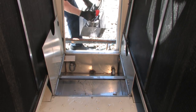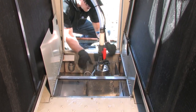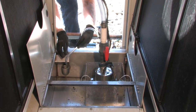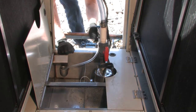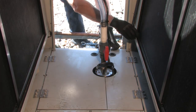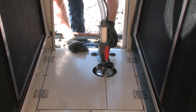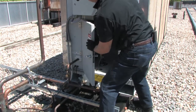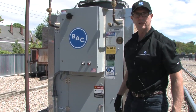We're going to put the pump back into the sump and put the stainless steel push pins back in. Again, as you can see, we haven't used any tools. We're going to take the bleed line and put it back into the overflow. If there's anything left in here, we can just pick it up and throw it out. Put the covers back down and put our finger bolts back. Make sure the bleed line is closed right here and make sure that's free. Close the door and lock the door. That's all there is to clean on the inside of the Trillium unit.